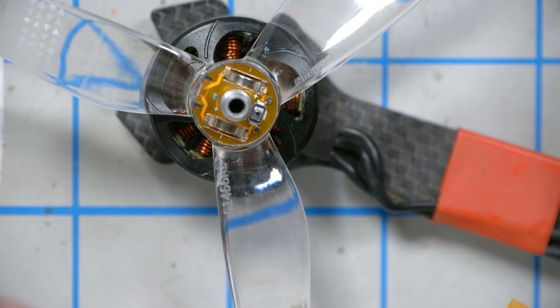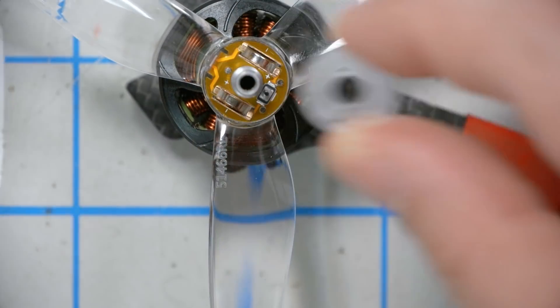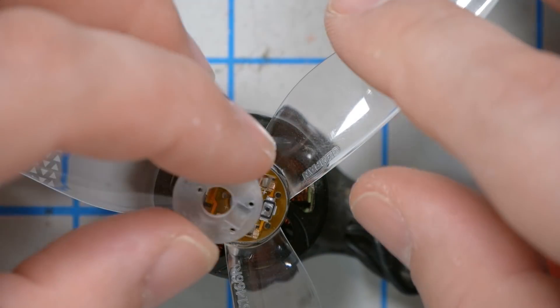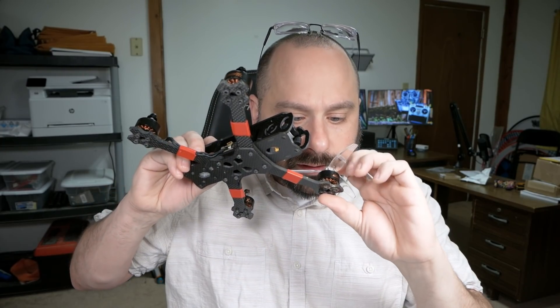At this point you may think it would turn on and work, but I think it has to be all squished together to actually work. So I'm going to put this on a quadcopter. They come with these little plastic tabs which have the same three alignment holes, so those are going to line up with the pins on the hub. Just do a visual confirmation that the pins are lined up — they don't stick in there that hard, but if you were to crank down the nut without the pins lined up, of course you'd have a problem.